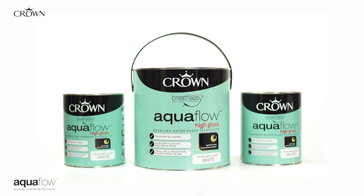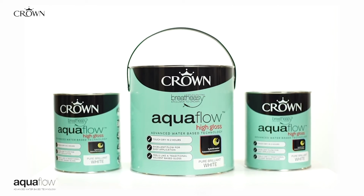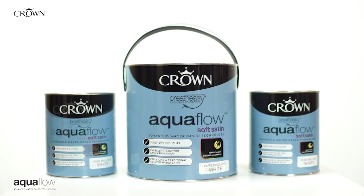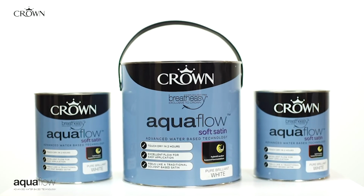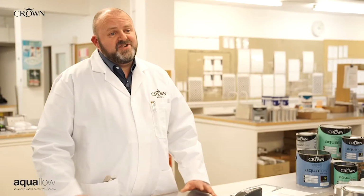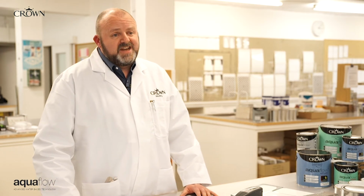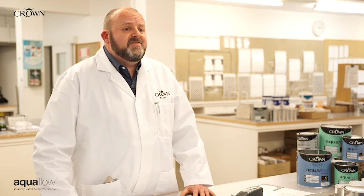We developed this system originally as a gloss paint. We then carried that technology that we'd used from the polymers into developing an undercoat and also a satin finish. So we've developed a contemporary satin finish to match the solvent-based satin finishes. The Aquaflow undercoat has been specifically developed to be complementary to the gloss and the satin top coats, to get the optimum flow and levelling, and to get the best gloss from the gloss paint and the best levelling from the satin paint.